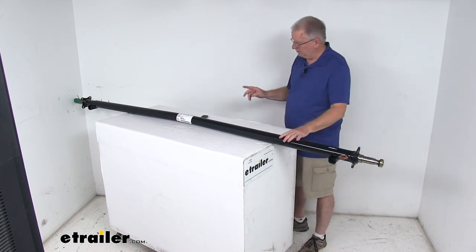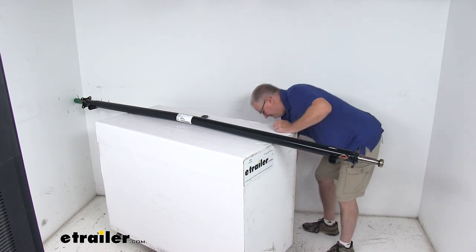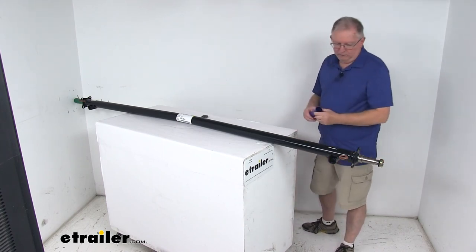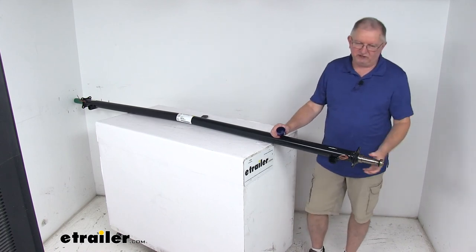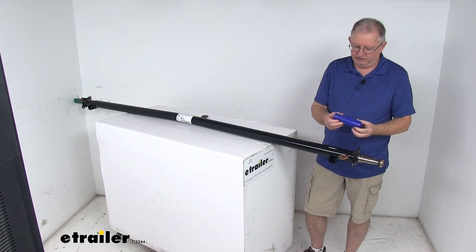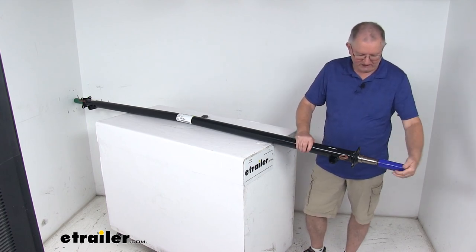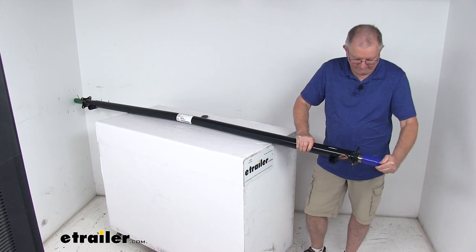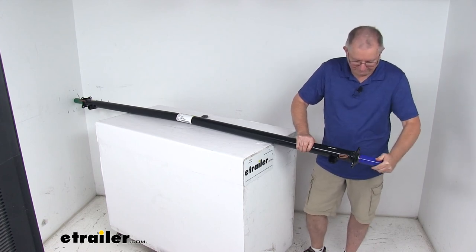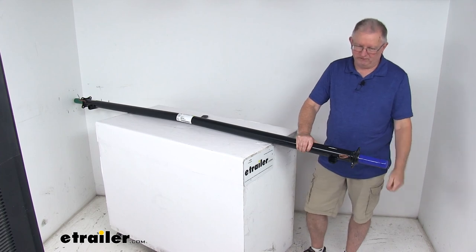When we ship these, we don't ship them bare. We apply a coating of grease to prevent corrosion, then take a thick rubber sleeve and insert it onto the spindle, sliding it all the way on. We ship them that way to protect them from damage and corrosion.